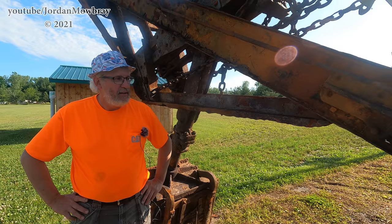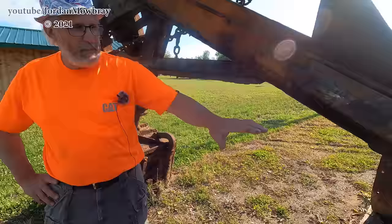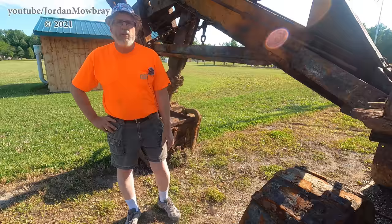And another thing we stumbled across, looking at his, because I believe his is a 1913 shovel, but there's so much difference between my lower half and his that we came to the conclusion that this is definitely one of the earliest models of this shovel, because of the way that the carrier rollers are mounted up and they're all Babbitt bearing and no eccentric adjustment on them. So to find the serial number plate would be huge.